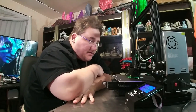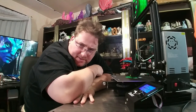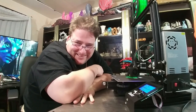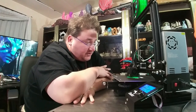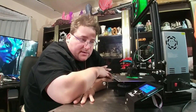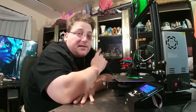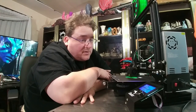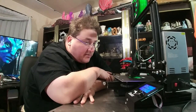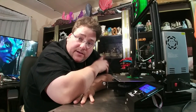I'm going to tram the bed to the nozzle and get the first print going. I had to do a little live leveling as it was printing — the sample print is a surprise, not a cat, though of course I'll print a cat too. It's actually doing a surprisingly good job — I see no stringing, it retracts and moves with no stringing at all. I'm running CC Tree fluorescent green filament at 60mm/s and 200°C, using the stock Creality slice settings. Next time I'll try cranking up the speed and printing my own designs.